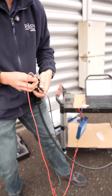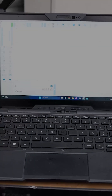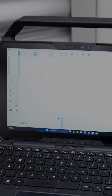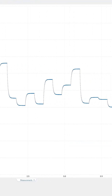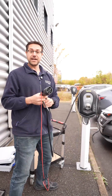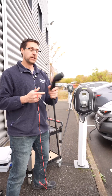So again we're going to measure across the PE and PP circuit looking at resistance, and there we go — we have 460 ohms. Now if we watch the screen, I'm going to try and manipulate the wire and we can see that resistance changing. Just desperately trying to hold everything in place as we wiggle the wire, and you can see it's all over the place and changing our resistance. So it looks like this has potentially got an internal failure with the wiring. We're going to strip this plug apart and have a look, but yeah this is most likely the reason why these Teslas are being so susceptible to not charging.